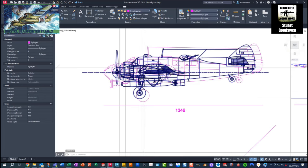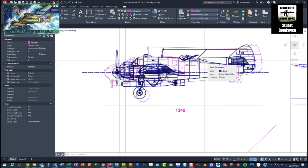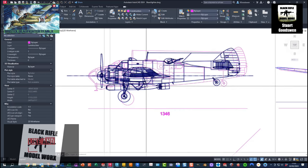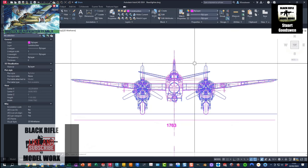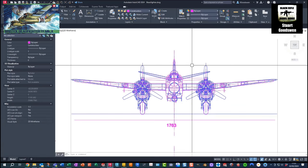The main difference starts with the airframe. This is the third generation, really - from the Blenheim to the Beaufort, and then the Beaufort to the Beaufighter. There were some exterior changes, but the main structure of the airframe remained the same. They did that because they wanted to keep as much of the original tooling and jigs from the Beaufort as possible, so they could switch production to the Beaufighter with as little stress as possible.